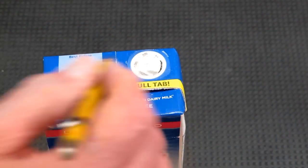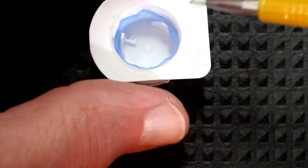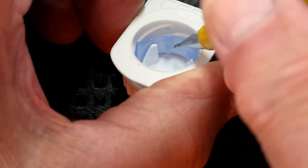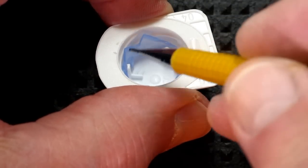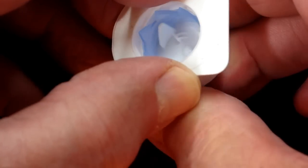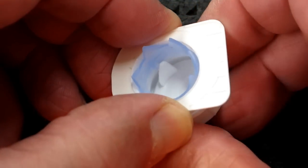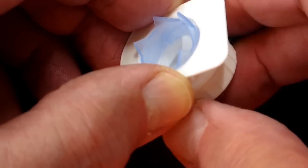The carton is sealed with a plastic foil and then this piece is glued on there as an assembly. Inside the cap are three fingers that engage with some little raised portions that are inside this blue cutter section. The blue cutter section has left-hand thread and runs inside the left-hand threads that are in the neck of the pour spout. As you turn the cap counterclockwise with the right-hand thread, the left-hand thread of the blue cutter section lowers the cutter section and the cutter cuts the foil and the cap comes off.